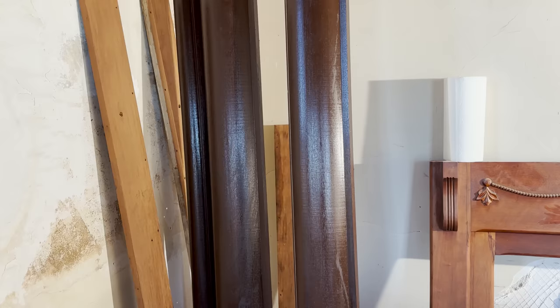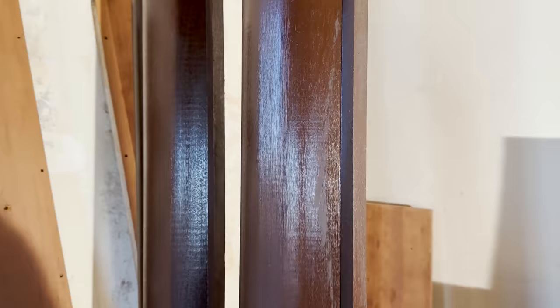On to these mondo pieces — these go at the very top of the cornice, wrap around the whole building, and they're absolutely gorgeous. You can see they're big, they're brown, and they're more or less ready to be installed, probably one more coat. Fun fact: because these are such dense wood — they're sapili — they weigh about 65 pounds each. They are quite dense, quite heavy, and there's just a lot of lumber here. As you can see from the back, they are solid. It's quite a shame to paint such a beautiful wood as sapili, but that's what they would have done back in the day. This is the rot-resistant lumber that was around at the time Eric was manufacturing these.